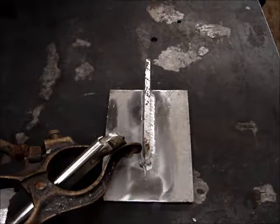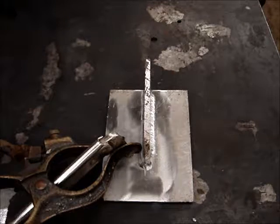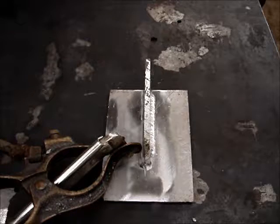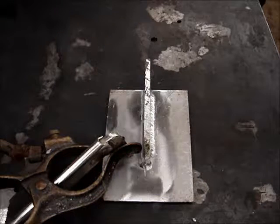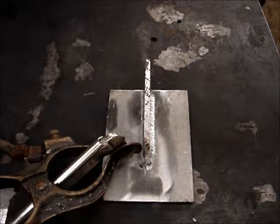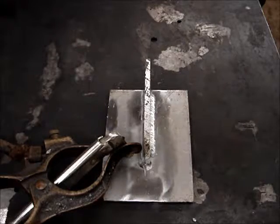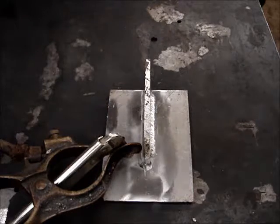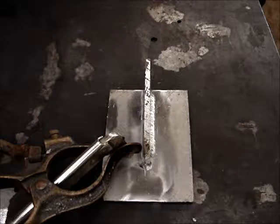There are a lot of new metals, pot metals and scrap metals that they're using out there these days that aren't very good. You can't even weld to them. I've had it where I've had a quarter size hole in a transfer case from a vehicle and tried to weld a piece of aluminum into that quarter size hole, and basically the weld looked perfect, but you could take a piece of wire and pop it right off of there. It didn't even take to it. So they're mixing a lot of stuff up out there that is not even repairable anymore. It's just pouring a bunch of stuff together and you get what you get. So some of that stuff isn't repairable.